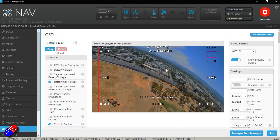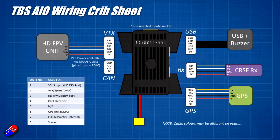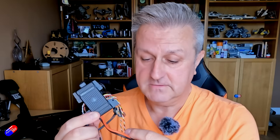We can turn on the preview guides and see everything is safe — this is a pretty standard layout for me and it's saved. On the Status page we have a full set of green ticks, meaning the iNav setup is all ready to rock and roll, and I'm ready to put this inside the wing for the next video. With it all wired up and the iNav basics done it's ready to plug into the Chapito. The only other thing I need — which comes with the production unit but not mine — are two short extension cables from S1 and S2 for the servos in the wing, so you can plug them in and out easily. I'll make those up now, and in the next video we'll install it, finish all configuration and testing, then it'll be ready to maiden.